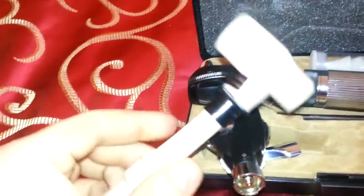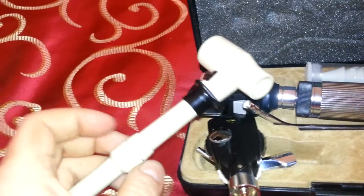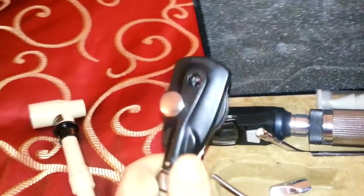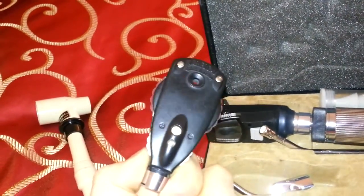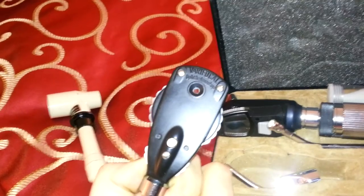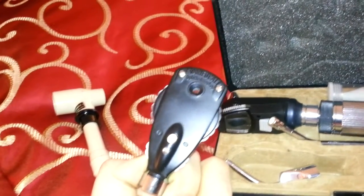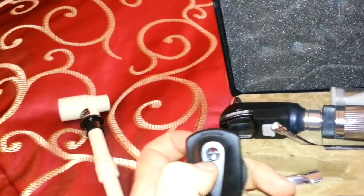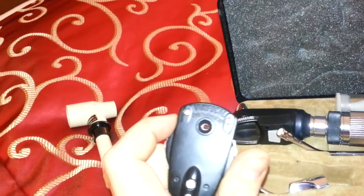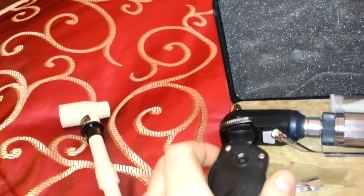If I were buying any one of these things — this cheap one is kind of fun to play with, but the optics are not great, the light source is alright, decent color, batteries don't last a very long time, and it seems to break pretty easily. If you can get your hands on something with one of these ophthalmoscope heads, even if it's not a fancy German one, with a working light — this is just amazing for looking inside locks and other things. Even just looking at metal up close you can see the quality of the metal, the finish, the grain structure of steel. It's a great little magnifying device, and it has the advantage that you can hold it at a set distance and change the dial for everything from zero magnification up to about 20x or 50x, and zoom in on the target or look deeper or shallower into a keyway or some hole.